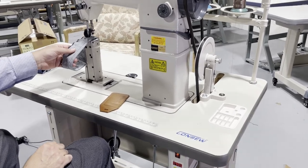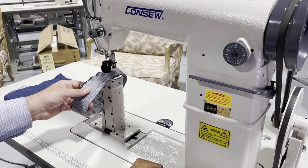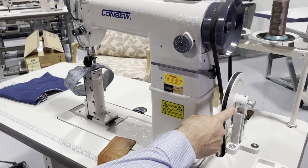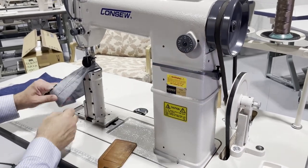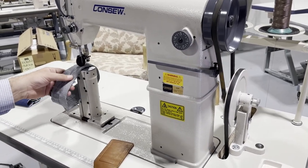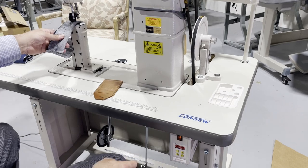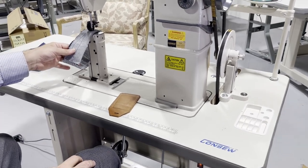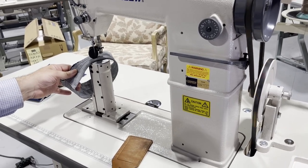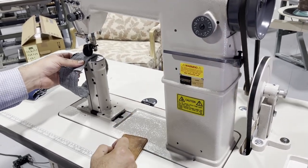I'm gonna set it to 900. You can see there is a belt going from the motor to the speed reducer, and one from the speed reducer to the machine. No matter the speed setting, it goes slow — you can do one stitch at a time. Even when the motor is running fast, the needle is going slow.